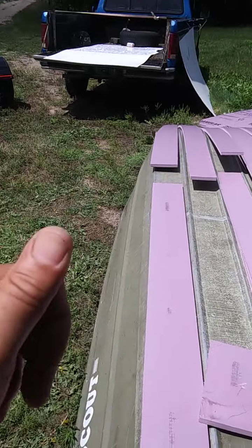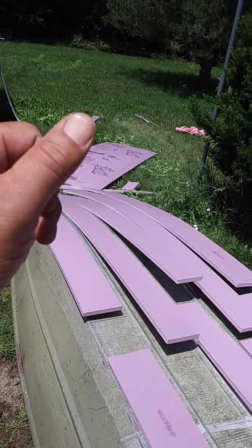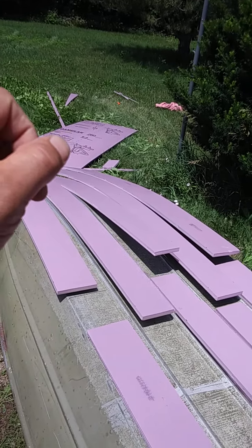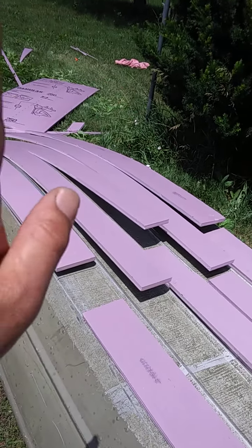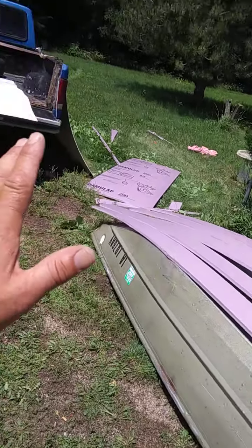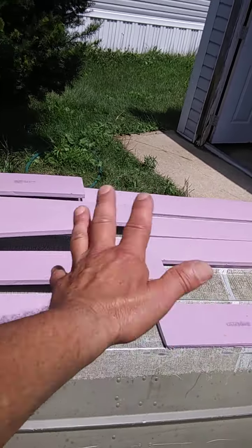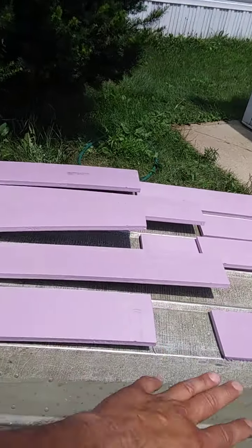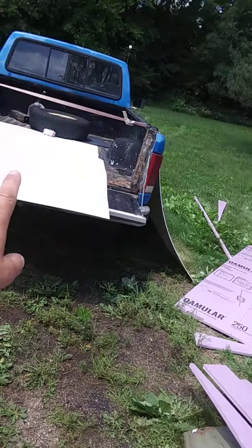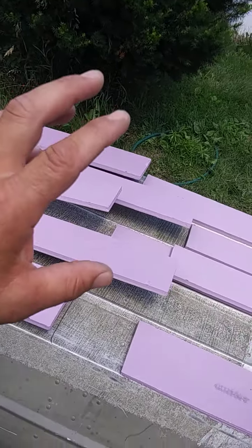That's what I'm doing so far. I'm going to have to run it back to North Fork though — I think I need to get some shorter bolts, stainless, all stainless, after I get this glued down. It's about 80 out here in the shade — I got an inch and a quarter of rain yesterday afternoon and now it's starting to evaporate, so it's awful humid and hot. But there's a little breeze kicking up, just enough where it ain't blowing my stuff away before I get it glued down. I've got two sheets of HDPE and I staggered the seams just to be safe, to level any compression areas and flex areas instead of one seam straight across. Hopefully the foam's extra buoyancy will offset the extra weight of the quarter-inch HDPE and it'll float like it usually would or maybe even a little higher.